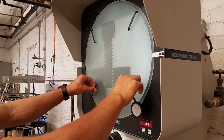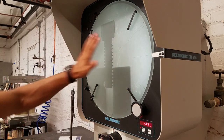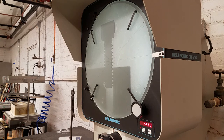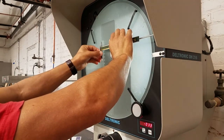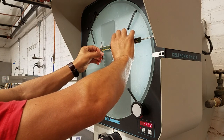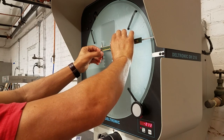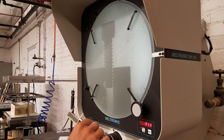I mentioned that these clips are for clipping a vellum or transparency on here so you can see through it. Now we can measure something — I could grab calipers to measure. Make sure these are zeroed — so that's inches. Obviously we don't want to scratch anything, so I'm not putting the tips in. That looks like about 2.43 inches to me. Because this is magnified 10 times, you just move the decimal place over one, so it becomes 0.243 inches. Because it's a 1/4-20 bolt, that makes sense.